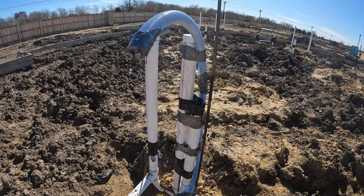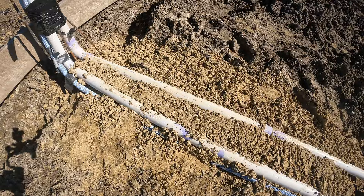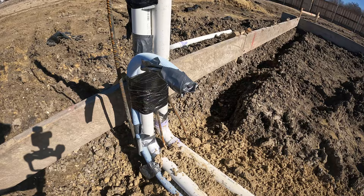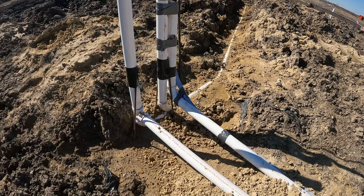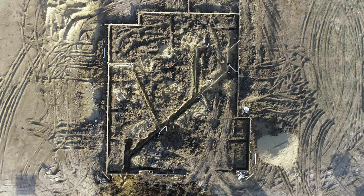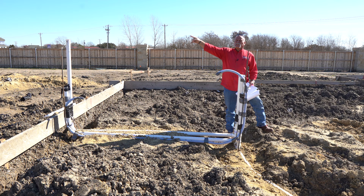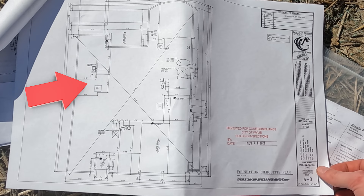Over in the kitchen area, you've got a two-inch combination and a two-inch sweep, which tells me this is going to be an island with a loop vent and a double vent off of it. It's not quite how I learned — for a loop vent you have a line going over to it, and there's another two-inch line coming over. To me this may be what they're going to pull the water lines through, to rough them in in this wall and have them behind there. Then you can take your vent up and out the roof.